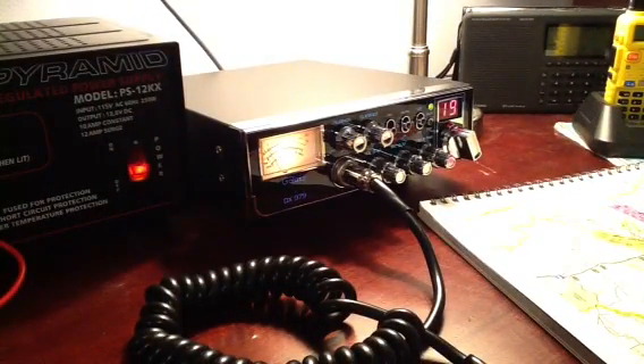I added a little bit of RG8X mini cable to connect it all together. The DX979 operates on the standard CB frequencies, picking up channels 1 through 40, and has SSB functions which increases the number of channels you can operate on. I've had some good contacts on the standard channels and reached out as far as just over 20 miles. The peak and tune appears, according to the S-meter, to be letting me get between 18 and 20 watts out, and it seems to be working pretty well.